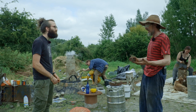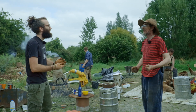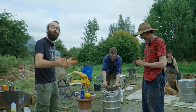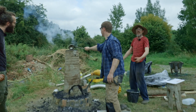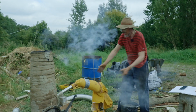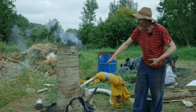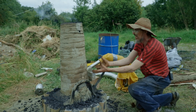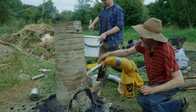So we can basically pull it out and hammer the hell out of it with great big hammers — it'll be great fun with sparks and stuff. In the past there would have been a man with great big bellows working hard all day, probably a team of men pumping. But we're cheating and using a bit of electricity and a modified raincoat to blow air in. This piece is called the tuyere — it's the air intake that goes into the furnace. The hottest part of the fire inside is a teardrop or egg-shaped hot lump, and the air is blowing in.